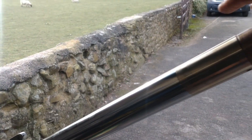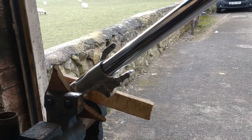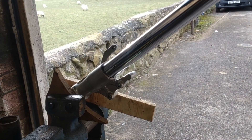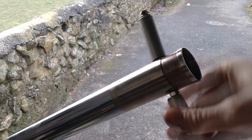So I've got it mounted in some wooden jaws, and we've got a hole that passes through both sides. We're going to have to find something to fit through there to basically unthread this from the bottom. I've made a little handle — it's an M6 stud with a couple of nuts tightened down, and then I've just got a bit of aluminium tubing to hold onto.